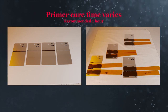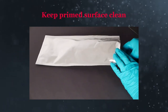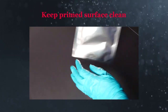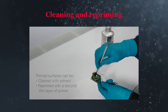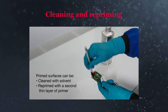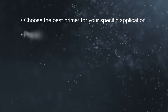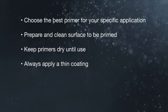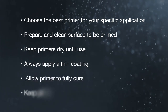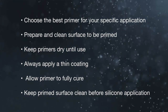Generally, there is a minimum required cure time, but not a maximum. If the primed surface remains clean, the surface should be ready for good bonding for days, weeks, or even months. If a primed surface is suspected of having become contaminated, the surface can be wiped with a solvent or a second thin layer of primer can be applied over the first layer. Once the primer has cured, you are ready to apply your choice of silicone material and cure according to that product's cure schedule. Priming cannot achieve perfect adhesion for all silicones to all surfaces, but can easily improve adhesion performance for many applications.